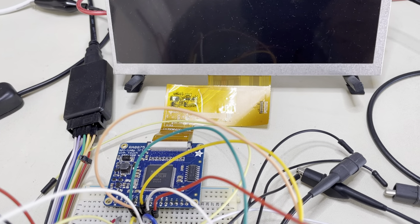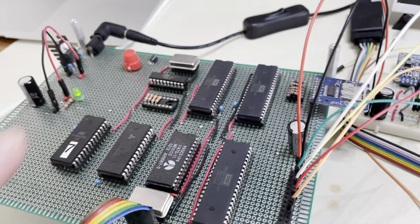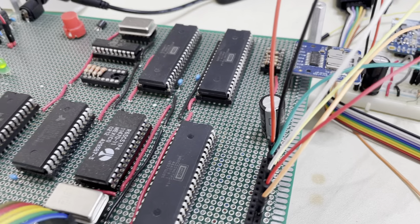The particular feature that appealed to me was that you can control it with an SPI protocol. I've already built SPI into my computer, because SPI is what I use to talk to the SD card there — which you can't quite see under all these wires. So I figured I already had an implementation of SPI. How hard could it be to drive this chip too? The RA8875 is connected via a flat flex cable to a 5-inch LCD display, and the other end comes to the 6522 here running on my computer, where I can bit-bang the SPI protocol.